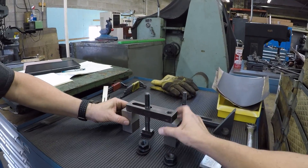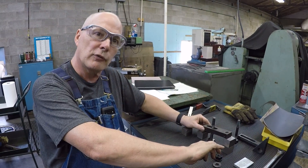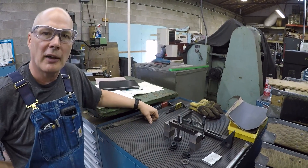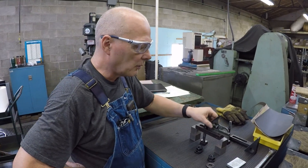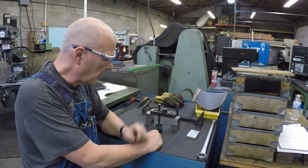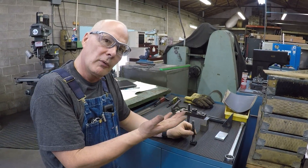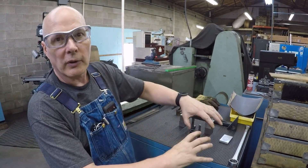You want to move the stud closer — but that's not the only problem. If I angle this clamp to an extreme, what it does is pull the part and distort it. You can take a level and put it on the clamp — people say that's a lot of work, but how important is squareness or distortion in the part? If the bubble is between the lines, it's probably good enough. When you have your stud in the machine and the clamp is at an angle, it's pulling on the stud, holding on this edge here and putting a lot of stress at one angle or another.